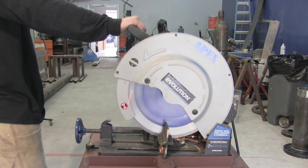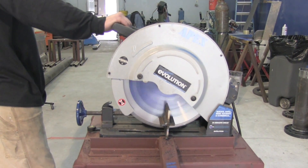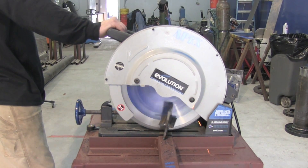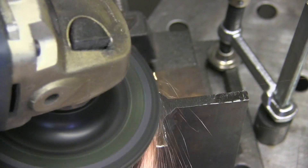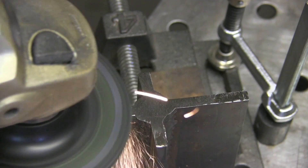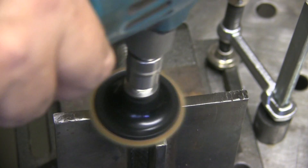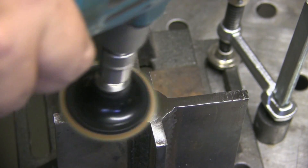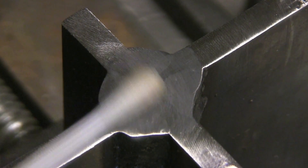It leaves a very nice finish, so if you're going to do a polish and etch, this is a really good way to do it because it takes minimal sanding and polishing to get something ready for acid etching. There are lots of different products you can use to reveal the weld nugget — naval jelly rust remover works, certain types of concrete etch solution work. Today I'm using a passivation solution for stainless steel, and it works really quickly.